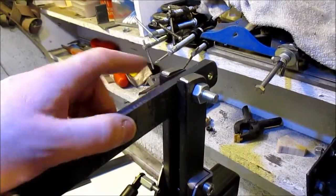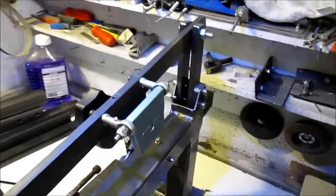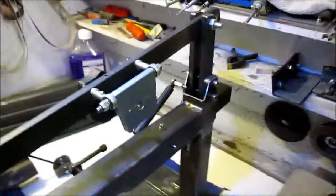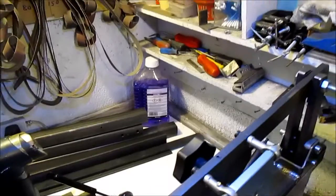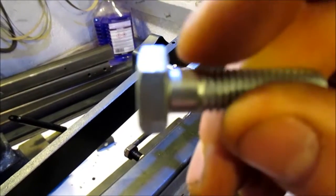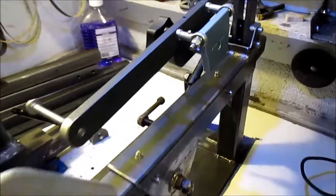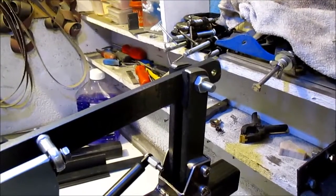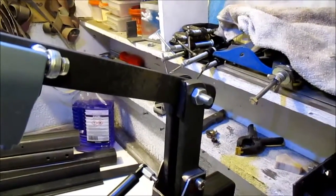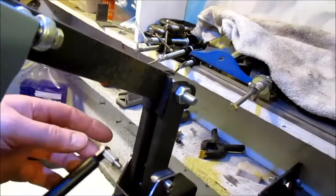I made the mistake of drilling and reaming the hole before I measured the bolt. I mean, a 10mm bolt, we think of a 10mm shank, but no, most 10mm bolts are slightly undersized. I've just had a bolt and I've put it down somewhere, as usual. Find anything. There we go. But yeah, most 10mm bolts are slightly undersized. This is a little bit short. I've got one with a 30mm shank there. So I'm either going to drill it to a different size, obviously measuring the bolt first, or find a bolt with a true 10mm shank. Some car suspension bolts generally have a better tolerance, so we'll see how that goes, or investigate something else.